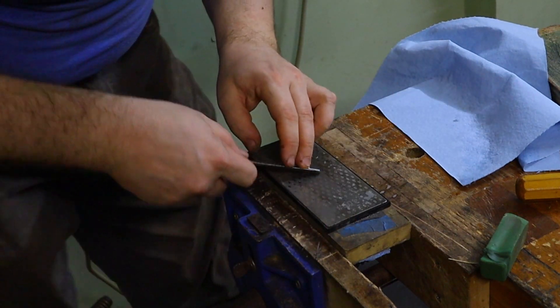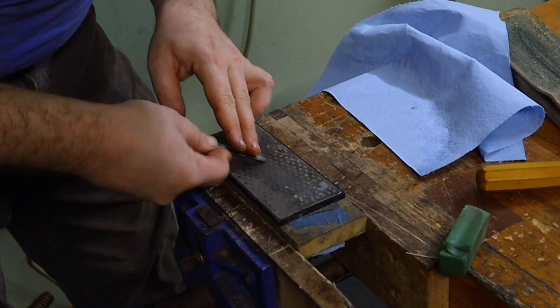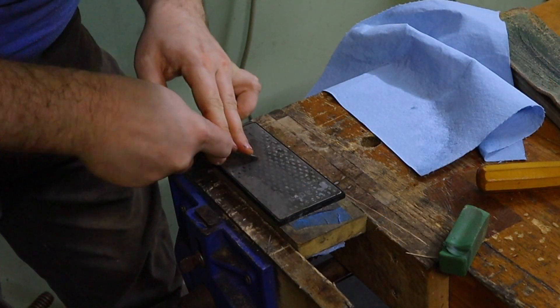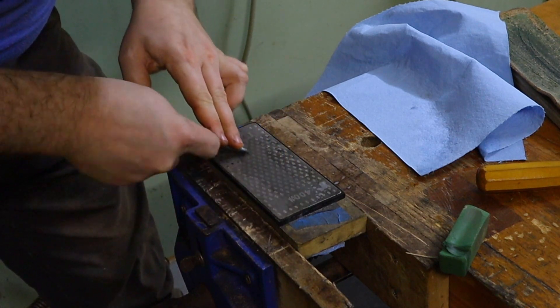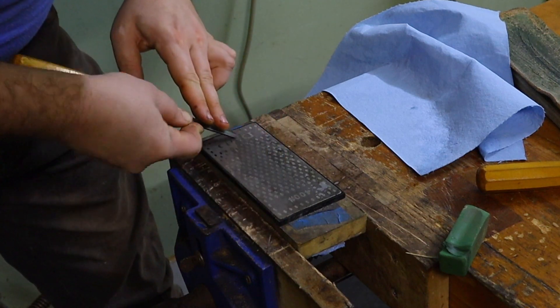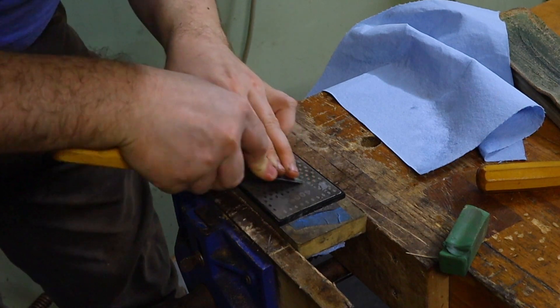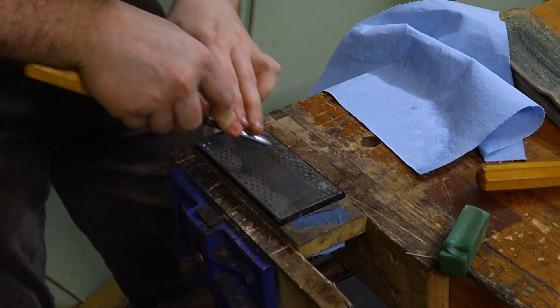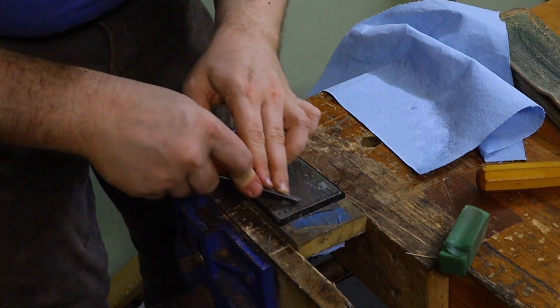There are probably jigs to do it precisely, but I'm cheap, so I'm trying to do everything freehand. Surprisingly, it's not that hard — even to get a super precise angle. Well, does anybody? But it will work in the end. For this gouge, I picked an angle that I thought would be correct — I probably should have measured more carefully — and started grinding with a rotating motion. For as long as you have reasonably stable hands, you can really do it, there's no problem.